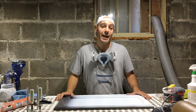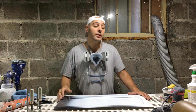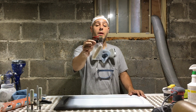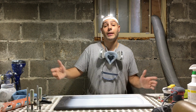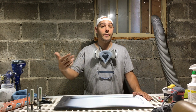Me personally, I like to do all of that by hand. That is cleaned and wet sanded on site by hand. And then the primer is applied with a velour roller, V-E-L-O-U-R, if you want to Google these. They are a great product. So the primer is applied with a velour roller. When it's dry, it's sanded with 220 grit, sometimes even up to 320 grit, depending on the cabinetry. And then from there, we start building up very smooth coats of the finished product.